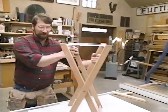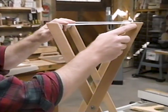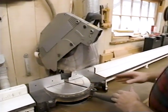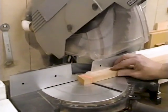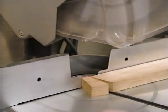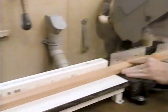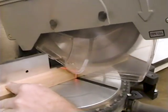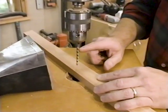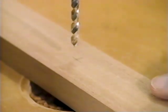Now for the stand. The first thing I need are four pieces cut at a twenty-three and a half degree angle at the top and at the bottom. To do that, I've set up my miter box, swinging it to one side to twenty-three and a half degrees. I'll trim one end of a piece, then slide it down to my stop, which I've preset for the correct length, and make the cut on the other end. The next thing to do is drill a three-sixteenths inch diameter hole in the center of each leg for the rivets that hold it together.